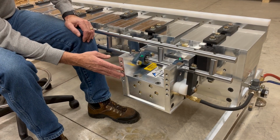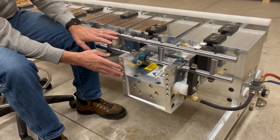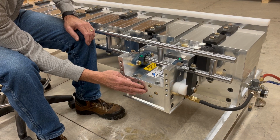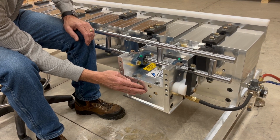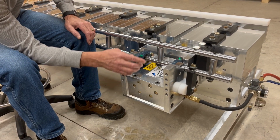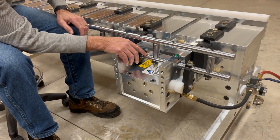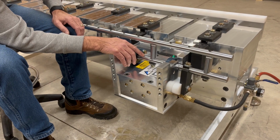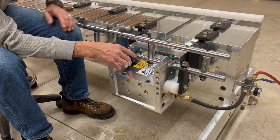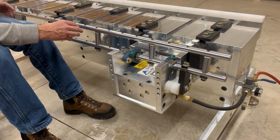So first of all, we call this a light duty system, not so much because of its construction, but due to the fact that it produces 350 pounds of push force at 80 psi inside the shaker drive. And then secondly, it utilizes a 1-inch diameter solid steel chrome plated pivot shaft and 2-bolt radial flange bearings with 1-inch inside diameter that support the pivot rack assembly.